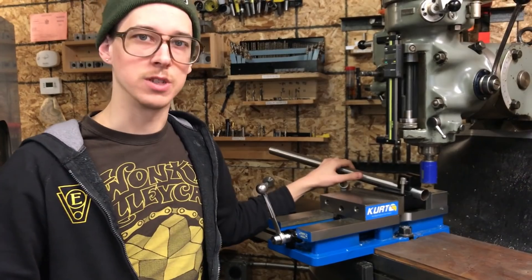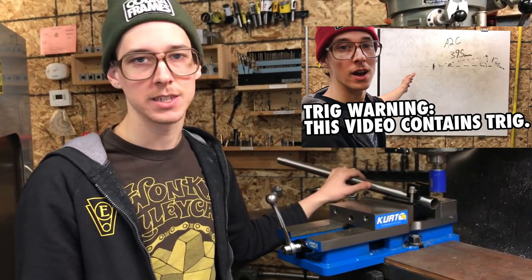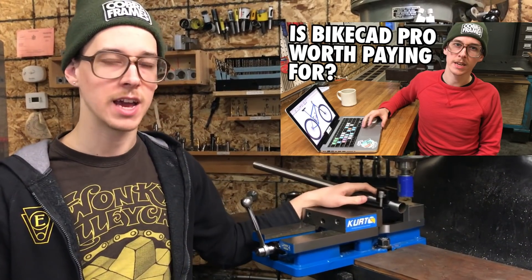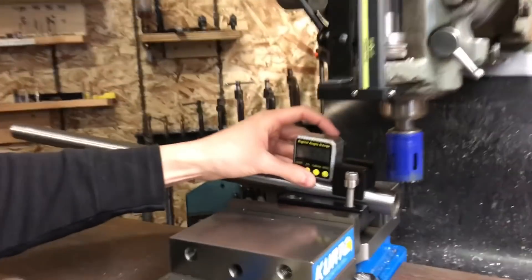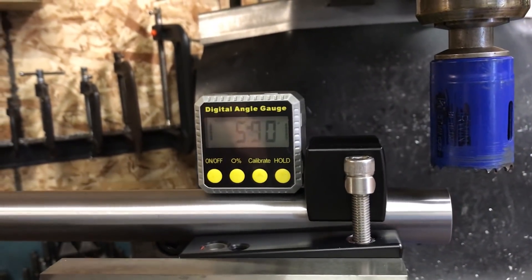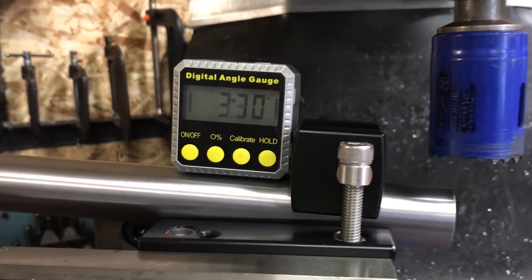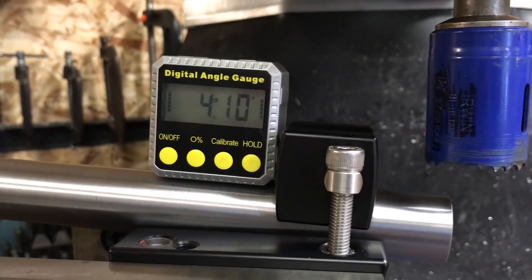When you want to miter your tubing, it's usually to a specific angle. You can derive those angles through trigonometry and math, or if you're doing test cuts for practice it doesn't really matter. If you're doing it for a finished bike, you can design it in BikeCAD and pull those degree measurements from there. But you need to set it to a pretty accurate angle, and my favorite way is with one of these cheap digital angle gauges. You just turn it on, set it right here — this one has a magnet so it holds itself in place — and it'll read the angle. You just set it wherever you need it and then you make your cut. That's my favorite way to set the angle; it's the most convenient, very affordable, and pretty foolproof.